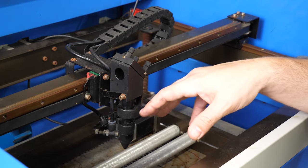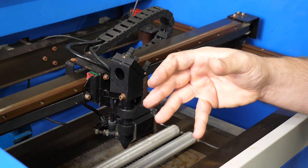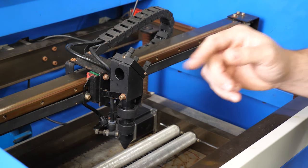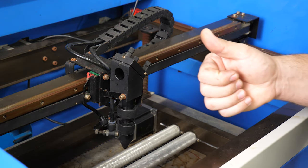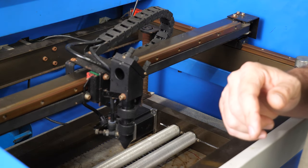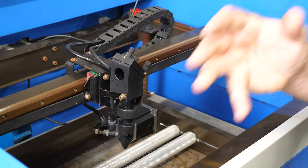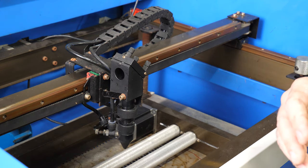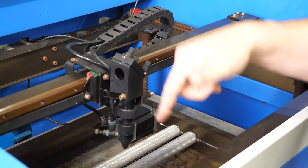So we're going to clean basically the lens — make sure it's intact and that this thing actually is going to work right. And then we're going to check all our mirrors. You need a few things: paper towels, acetone. We use a little bit of degreaser around some of these items too. And then for the actual lens itself, you want isopropyl alcohol — only use that on the lens. The mirrors are a little bit more robust and you can use different things on those, like window cleaner and alcohol. The main thing is you just don't want film on it.